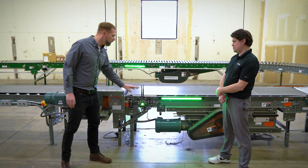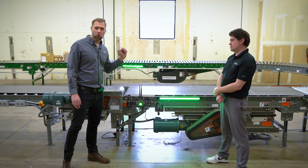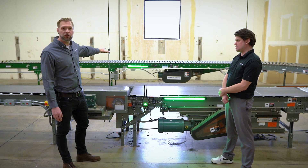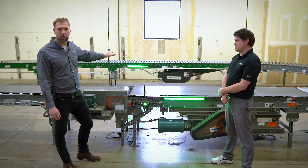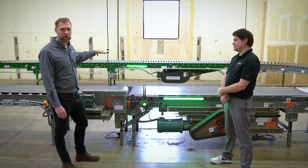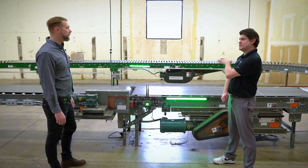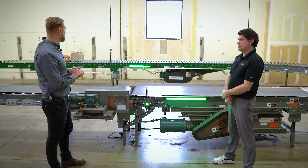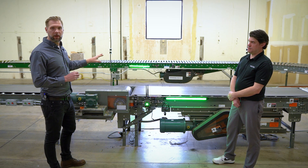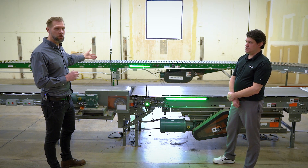We can monitor very quickly here with the wired Modbus line — one-second sample rates, things like that, right at the controller. And then we're monitoring condition data on the other side with the R70 wireless monitoring node and the same network of sensors coming back to the controller. That does require power on the other side of that R70 link. So where you have available power, you want to use that R70 node — copy that same set of sensors — and that's also why you can power the indicator over there as well.